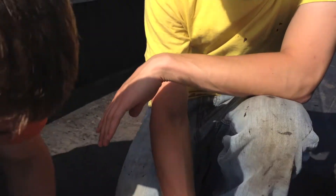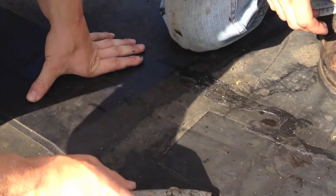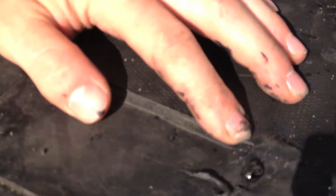Just to show you how hard it is to find a leak on an EPDM roof — right here where we're poking, what appears to be a pinprick is actually a major leak. When water ponds and pools here, it leaks straight into this small hole and creates a big problem on the inside, because now there's a small reservoir of water underneath the membrane.